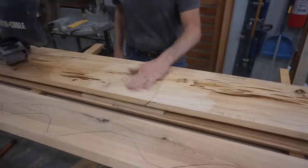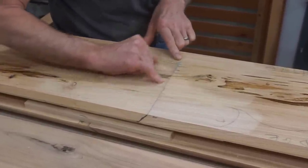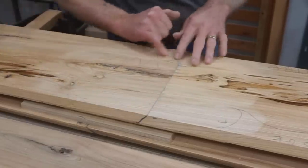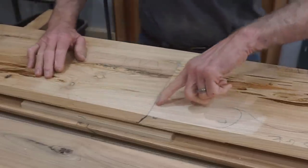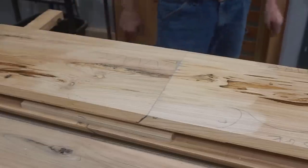And that's pretty much all it takes to clean the excess glue off that joint. And remember, these beams get a dark gray faux finish, so the little bit of epoxy that shows there isn't a problem. If this beam was going to get stained and lacquered, I could have used clear epoxy and that seam would hide quite nicely as well.